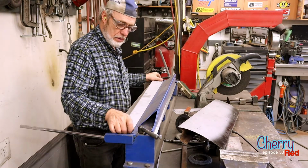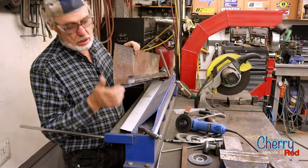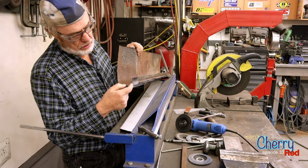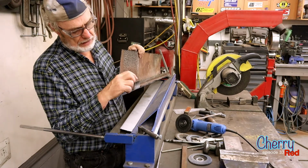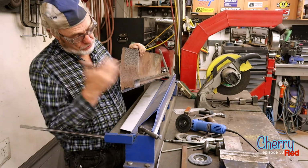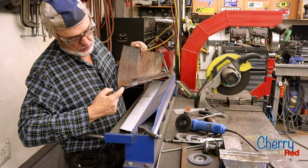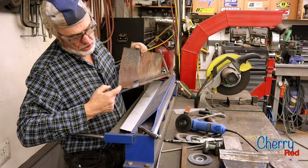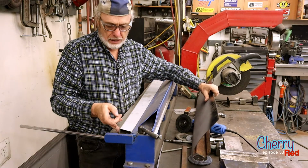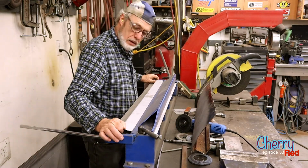So we have cut this piece to the bottom frame, inch up, 2 inches over, 1.5 inches, leaving a little extra because we're going to do a butt weld on the inside skin of the door, with the zip disc thing that we talked about. So I'm going to eliminate this little hump in here, no need. So it's going to come up an inch, come over 2 inches, and then up. So I've bent it up an inch already, and then I've got to go over 2 inches.